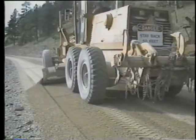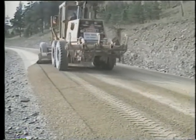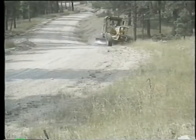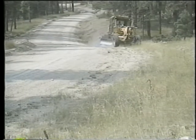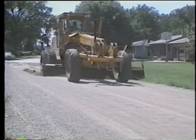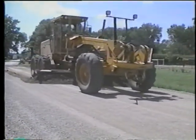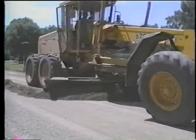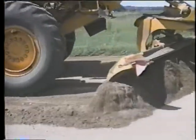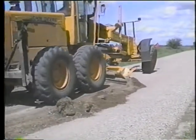The basic tasks in maintaining gravel roads include smoothing, reshaping, and re-graveling the roadway and shoulders, and cleaning ditches. Smoothing a gravel road may also be termed blading or dragging. It's a routine maintenance operation aimed at restoring a road's crust by collecting loose fines and gravel and re-spreading them evenly. The fines and gravel break loose because of normal traffic action and weathering.